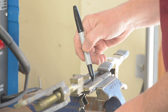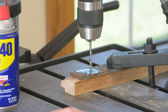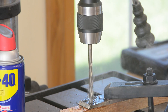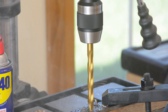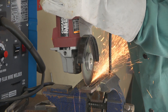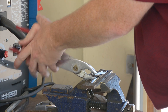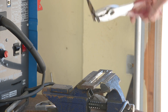I put the original piece in the vise and used it to trace out the slot that I'm going to need for the bolts in the back. I used some drills — had to do it in three passes to step it up to the right size — to do the two ends, and then came back to cut out the middle. I originally tried to do this with a jigsaw, but it was a massive fail, so I ended up back with the cut-off wheel. This is exactly as much of a pain as it looks like, trying to cut along a line between two circles with an angle grinder, but in the end, with the help of some pliers, got the job done.